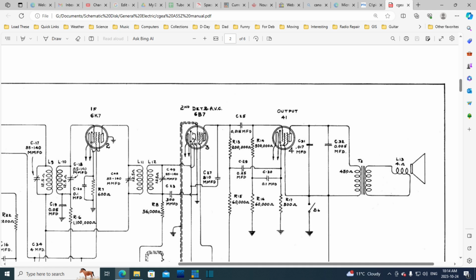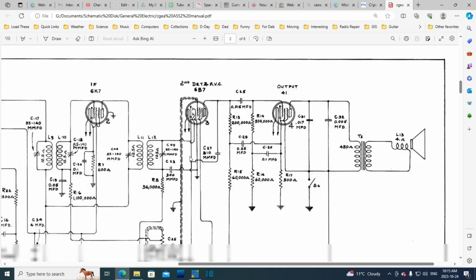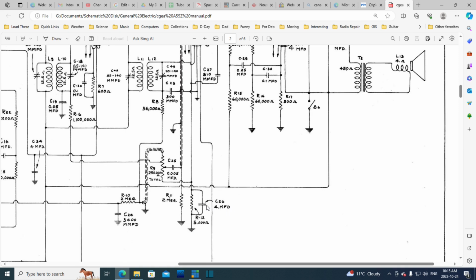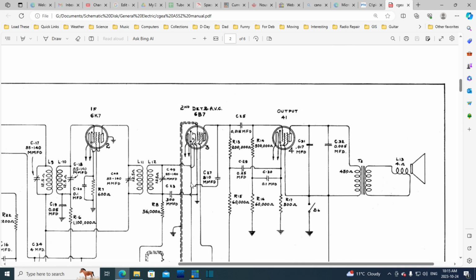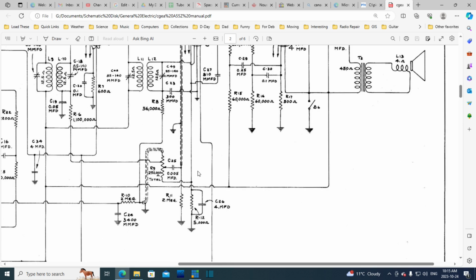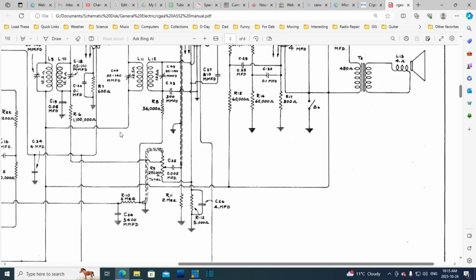Comes around, diode, and then the cathode here is connected to ground through another big capacitor. What are they doing here? So this is another one that's got cathode biasing on it. Look at the size of the bypass, 4 microfarads. Another big capacitor. Okay, well, we don't have any negative voltage, so they decided to do it this way to provide a biasing in here. Did I get that right? Biasing. Yep, on the cathode. Okay, you following this? I'm kind of going around in a bit of a disorganized way, but I keep clicking the button by accident. I have a trigger finger.